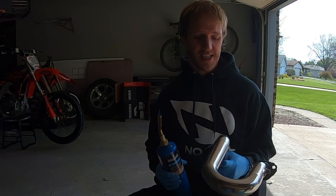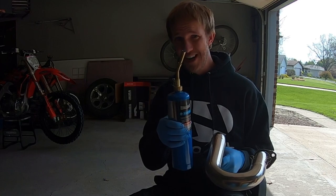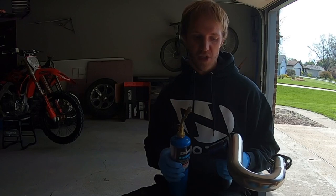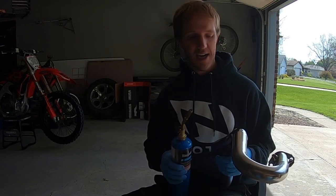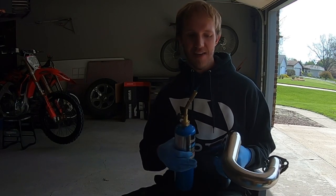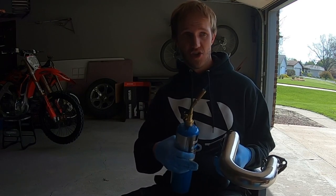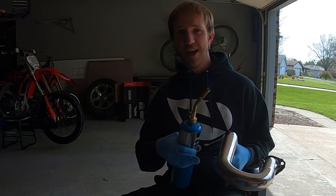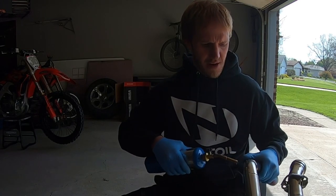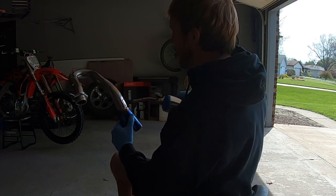There are a few things to watch whenever you're doing this. Obviously the first one is don't burn yourself, because that's no fun — this thing's pretty hot, even though you can't see it. What I usually do is start at the welds, because that's a little thicker and it's a little bit easier to work a section between. You want to heat it evenly and not get it too hot in one spot before you move to the other, because if you do that, that color just never comes back. So you want it to be as even as possible. I always try to start with the welds and just heat it even.